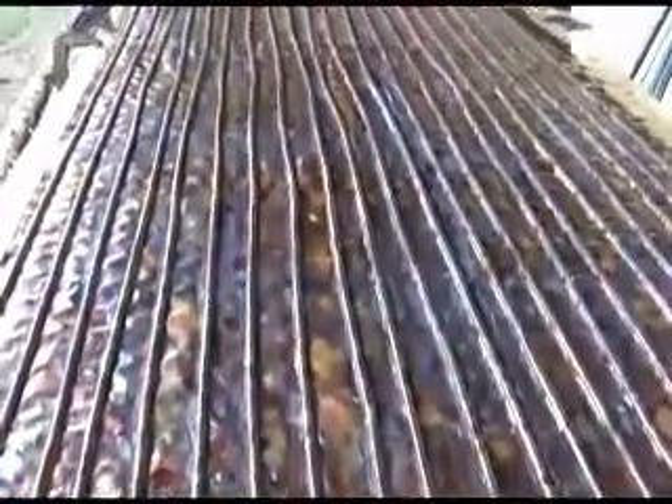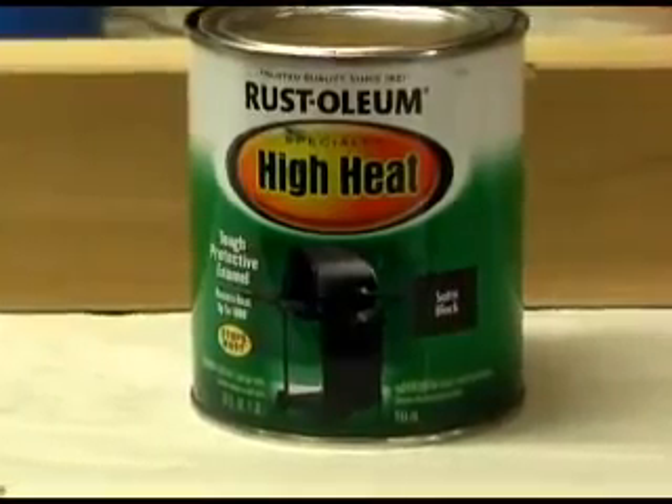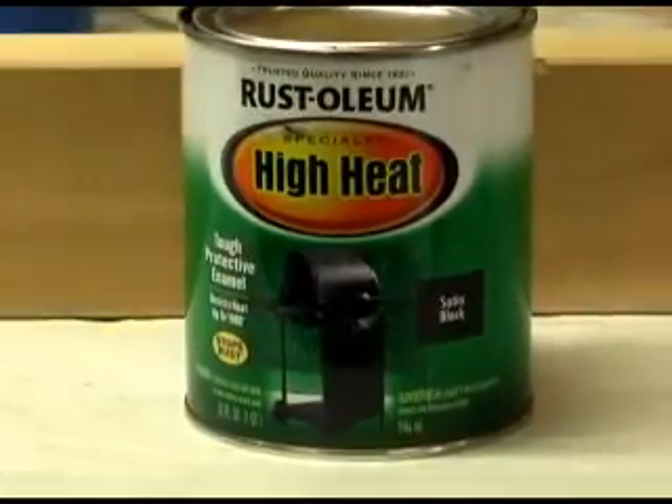The other side of the sheet is the face of the panel. I sandblasted the face of the panel to roughen up the surface for painting. I used Rustoleum high temperature paint without a primer and sprayed the face of these panels. I let the panels hang in the basement for about a month to let them off-gas before putting them into the boxes.